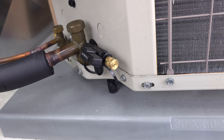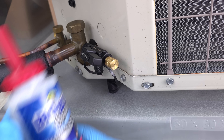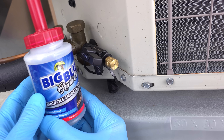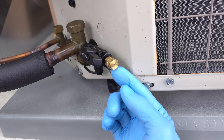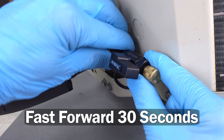Now we're testing and waiting to see if we're going to blow any bubbles. This avoids putting any non-corrosive bubble leak detector in the port or into the VCRT — it just remains on your little test cap. It's a nice and clean procedure. I don't see any bubbles forming, so it looks like we're good.